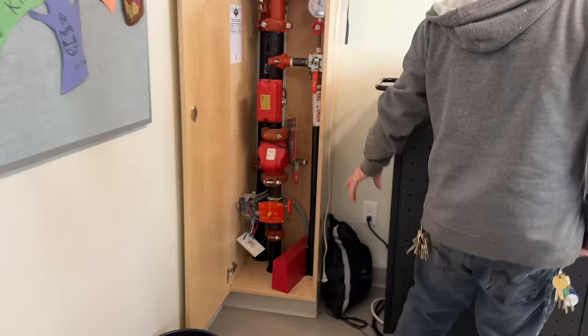The batteries actually don't need to be as big in here. So originally, everything was run off the aux power, which was too much, tripping it out. So then we put it on the main rail power, which is also powering the CPU, and that was also too much for that. And when we hit drill, it killed the whole system, took the whole panel right down. So then we split it, put one of these on aux power, one on the main power. And then that was fine, but our synchronization called technical support. They basically said, yeah, that sucks. That happens lots. That's literally it.